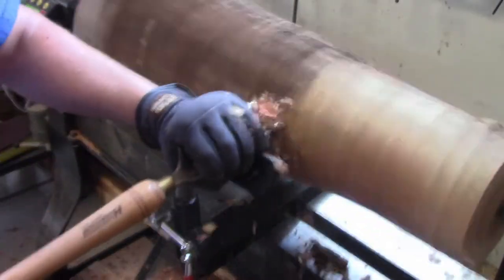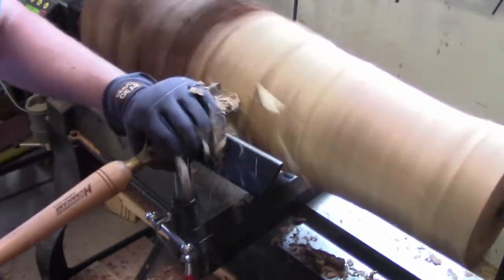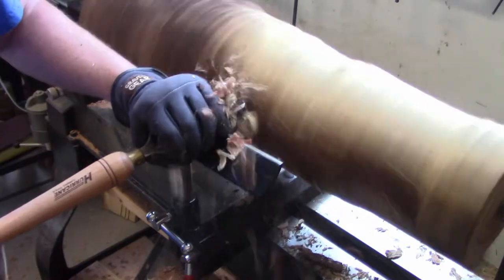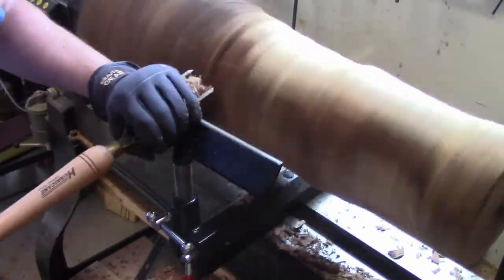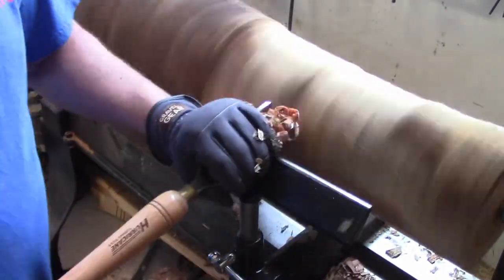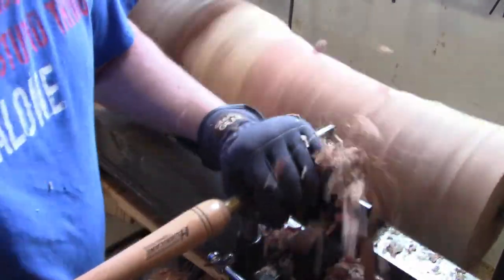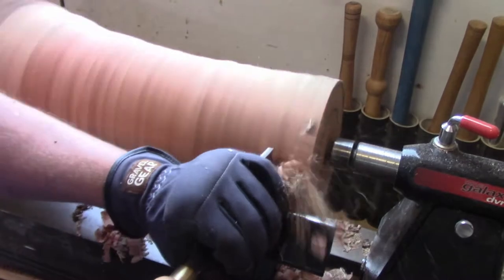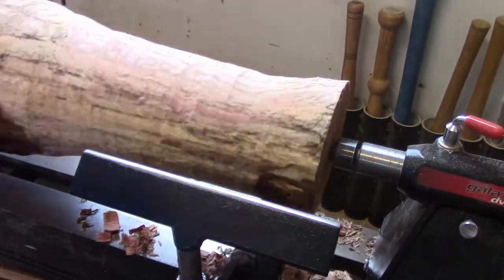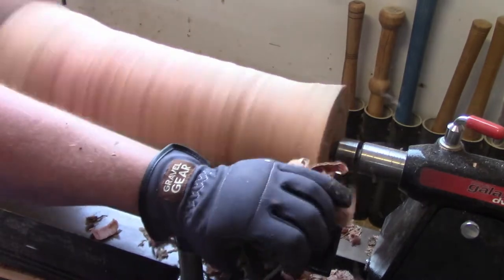I started from the back because that was the most off-center piece. It was really hard getting this big log on by myself — I probably could have used help — but I figured that part would be the handle, and I just tried to get this thing around and trued up. The roughing gouge worked really good; that thing's nice and sturdy and strong, and I sharpened it before we started. The ends I didn't really care about because I knew I was going to be cutting them off, so I was just trying to get it round and true.